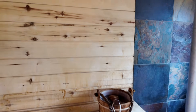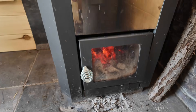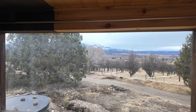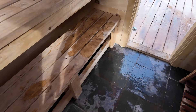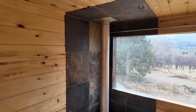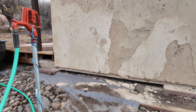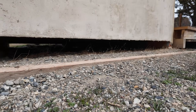We have a local mill that makes this aspen tongue and groove. A lot of people use cedar in saunas, but aspen also works great — some people are actually allergic to cedar, so aspen is a more universally acceptable wood. If you build your sauna right, you will not have any problems with rotting. He's got his benches, a nice slate floor, and slate surround for the stove. The one thing I didn't really like was the treated 4x4 and paver foundation — the flex this creates in the building may contribute to the trouble being had with the stucco.